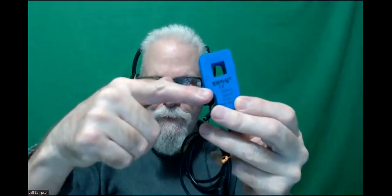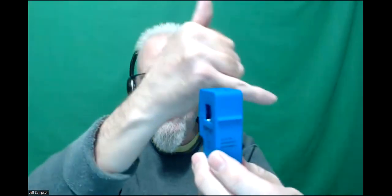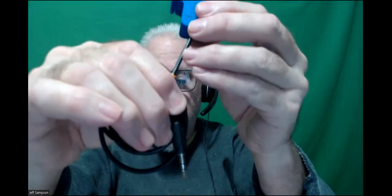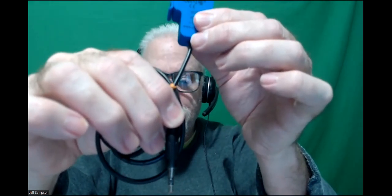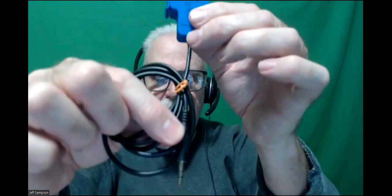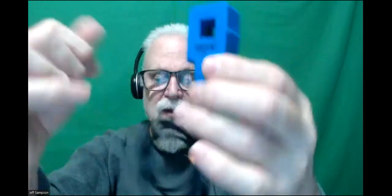You can also get this other version on Amazon - it looks identical except the number here says 30 amps slash 1 volt. So if you've got 30 amps going through the wire, the voltage coming out directly gives you a voltage - it's got a built-in burden resistor, just a resistor across the coil. So theoretically if I run 30 amps through this way I will get 1 volt AC coming off the connector.